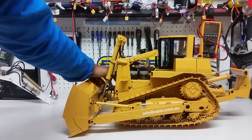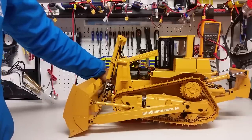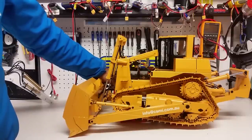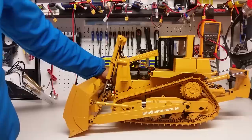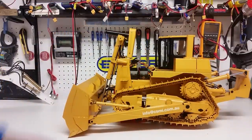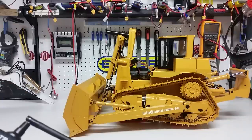The tracks are actually load sharing — you can see up here the tracks are fully load sharing. As I push the right-hand track down the left-hand track goes up and vice versa. There is plenty of torque in this machine because you've got planetary gears inside the hubs, so you wouldn't be able to stop the tracks with your bare hands.